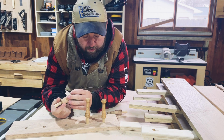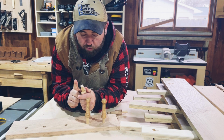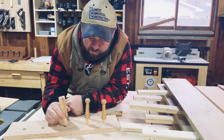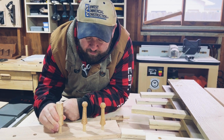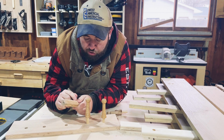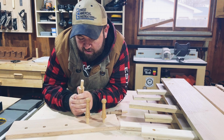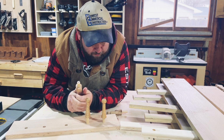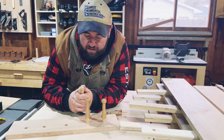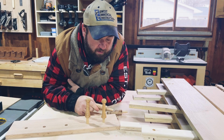What really became my issue is I think when I drilled this 1/2-inch hole for the dowel. So my thought process was, I know this will fit in these holes, right? That way I don't gotta worry about taking too much material off, making that tenon myself. But it's just caused issues. It made 3 of the 5 split, and then I had to re-glue. It's not holding up good. These two didn't split, and these two turned out great.